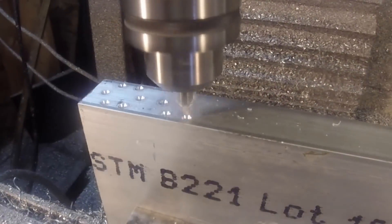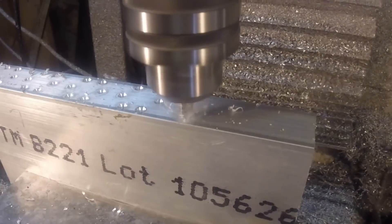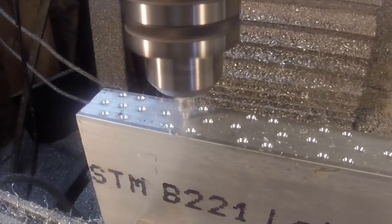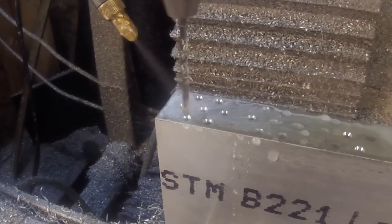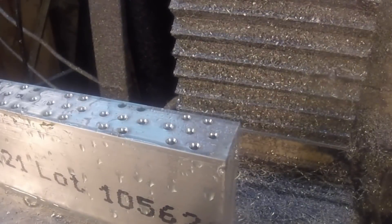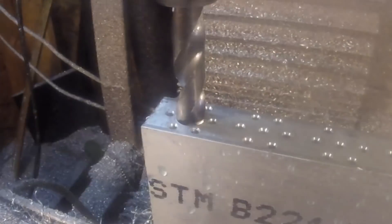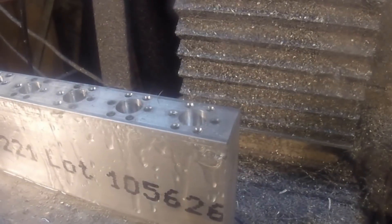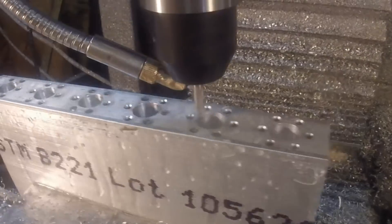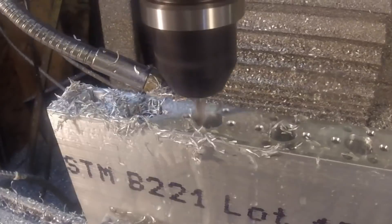Today's project is a small fixture for holding cutoffs of hex bar stock. I'm drilling a bunch of small holes — a series pre-drill followed up by small drills which are going to be in the corners of the hex, because a round end mill can't cut a sharp corner so the holes act as a relief. I'm using a half inch drill to clear out some stock quickly, then following it up with a 3/16 inch two-flute end mill to give me the shape I want.